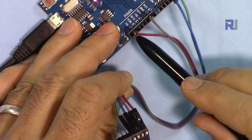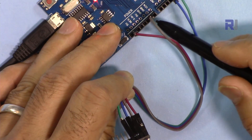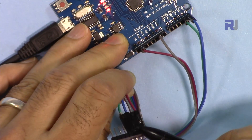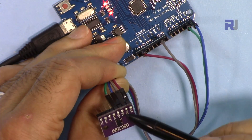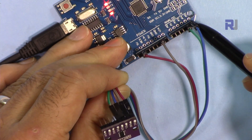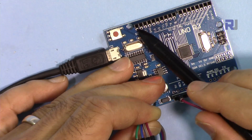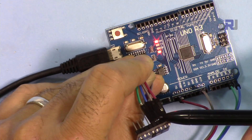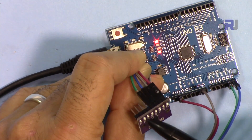For the wiring: VCC is connected to 5 volts on the Arduino. The second pin is ground — the gray wire goes to ground. SDA (green wire) is connected to pin A4, and SCL (the clock) is connected to A5. If your Arduino has dedicated SDA and SCL pins, you can connect directly there and leave A4/A5 for other purposes. No other pins need to be connected unless you want to use the interrupt or X-shut.